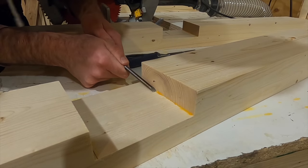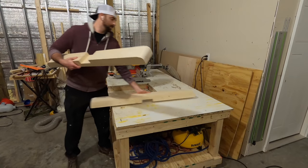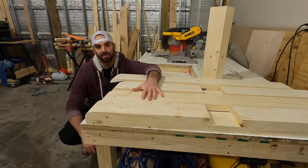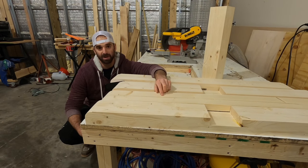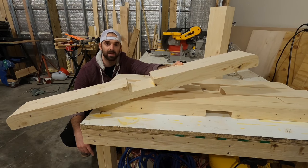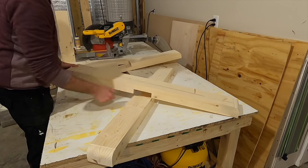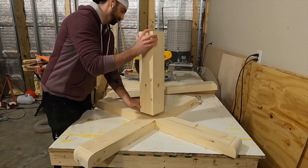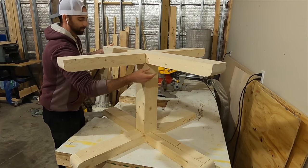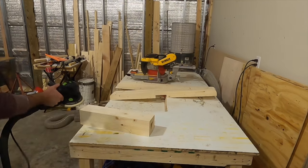Before I could glue these together, I cleaned up one edge where there was some glue left over. If you're using stain, you'll need to get all the glue out before staining, otherwise those glue spots will show. Just kidding about a sponsor — at this point we've got four leg frames and the main post, all the pieces needed for the frame. These pieces have a gap cut out on each side to make a half-lap joint where they cross in the middle. I'll sand these pieces down and then glue them up. Here's a look at how the pieces come together — they fit perfectly in the joint.